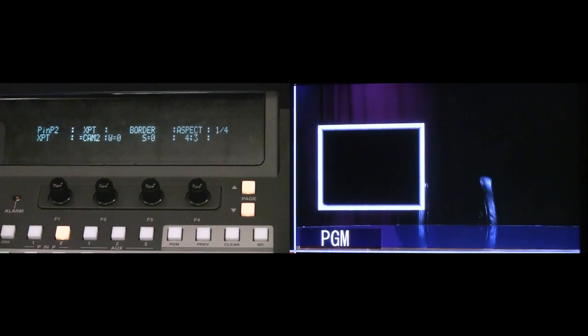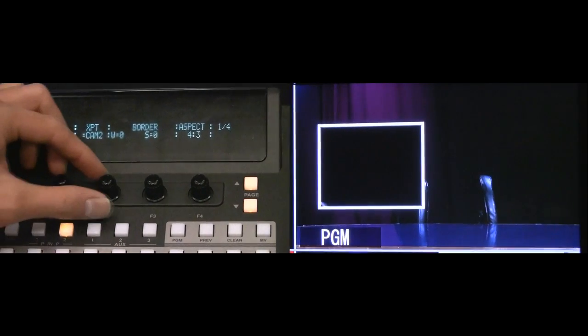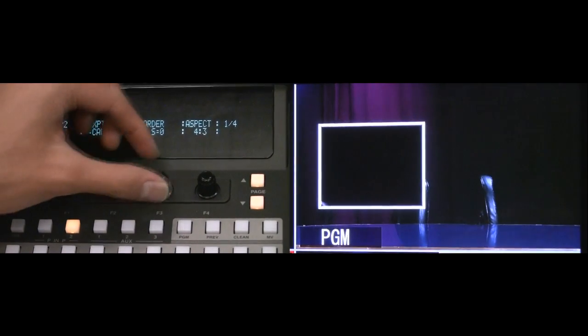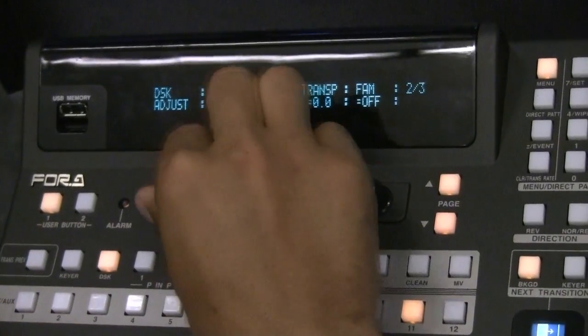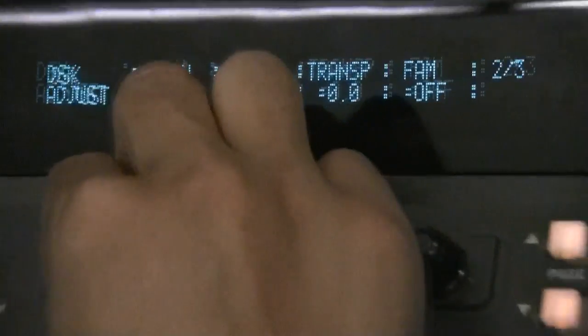What if I wanted to make the picture-in-picture bigger and give it a border? That's easy. Use the function menu here, these ones here, to adjust the attributes such as the width, softness, and gain. Why would you want to do that? So you can control the image that you're superimposing over the video. What would be a good setting to start with? Well, our graphics look best at 6.2, but be careful not to turn the gain up too high, because then you'll lose image quality. Sweet. Now let's set up the chroma key.